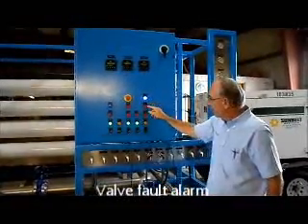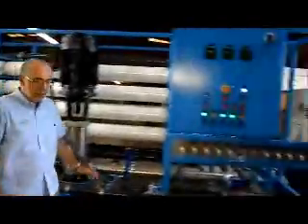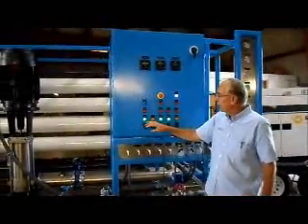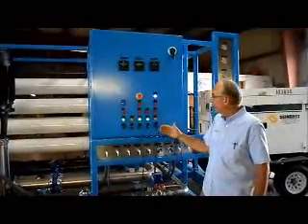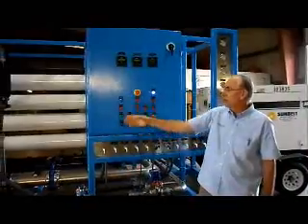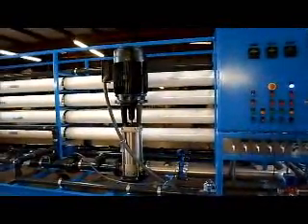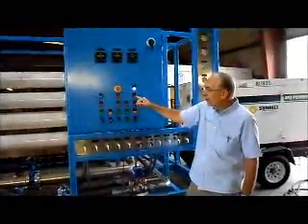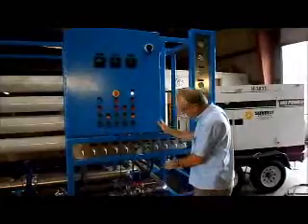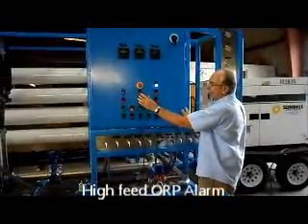This alarm is what's called the valve fault. It applies to the flush valve right here and the automatic inlet valve right here. These valves are equipped with limit switches which indicate the position of the valve, whether it's open or closed. If for some reason the limit switch indicates the valve was not open, this light is illuminated. If we tell the valve to close and the valve closes but doesn't close all the way, or doesn't close at all, and the limit switch doesn't indicate the valve is in the fully closed position, we get the valve fault alarm. If you do get this fault, you need to go look at the actuator for that valve and the flush valve to make sure that the limit switches are in the right position and everything is operating properly.